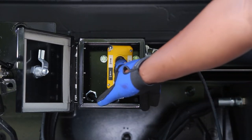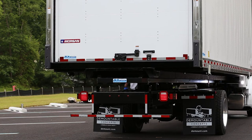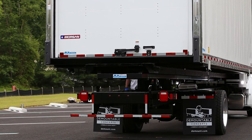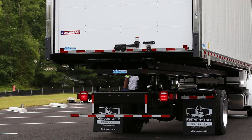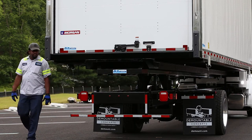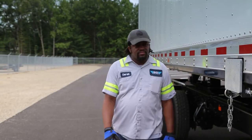Open the small control box and press the up button to raise the container. The container is normally raised about 6 inches above the truck frame. Lifting height will vary based on your particular operation. Now you are ready to set the legs. Always wear gloves to protect your hands while working with legs, and never put your fingers into the holes in the legs. Start with the passenger side front container leg.